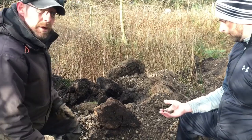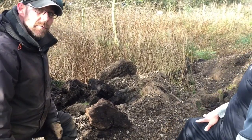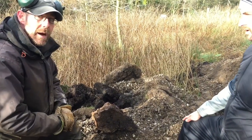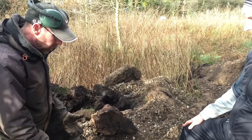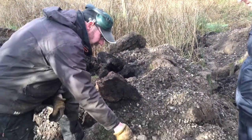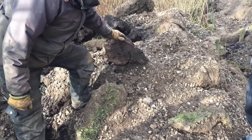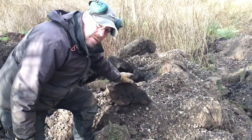That's a smaller gravel — your 20 to 10mm — which was the old spec of what they used to recommend at SDRI, but specs have changed as time goes on. But you get that good stone down there, and that stone is going to drain better than the peat block, because that is just a solid block. Nothing's coming through that at all.